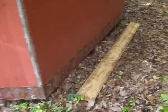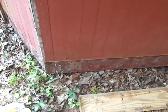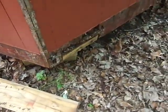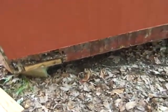I left this piece here. This is a treated piece that we put up back in '93 or '92 when this building was moved for the second time. You have to take it apart because of these carriage bolts at the corners, which were covered by that. But this was also a means to cover up some rotten parts. I believe this has gotten a little worse — I don't remember this from 21 years ago, but it has been 21 years.